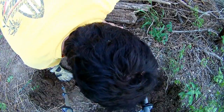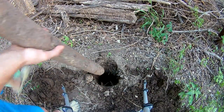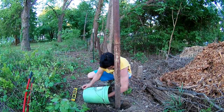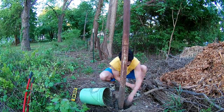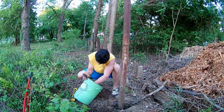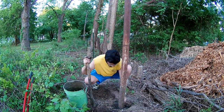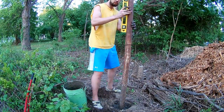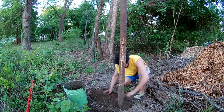You can also add sand to your mix and that might help it prevent cracking. But really it just depends on the soil that you are using. In general the thicker the mix is the less likely it is going to crack. I find that one 5 gallon bucket about 70% full is more than enough for a 2.5 to 3 foot post hole.